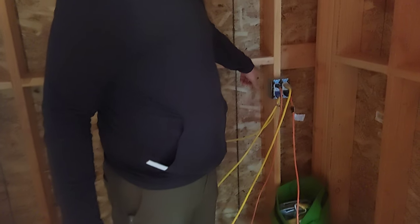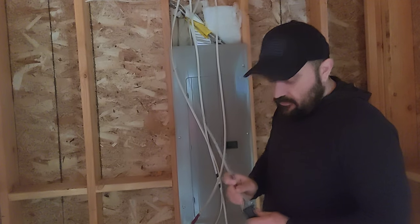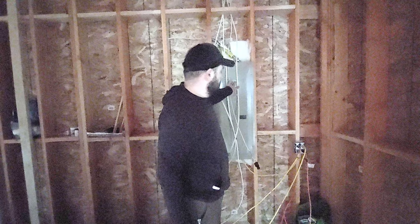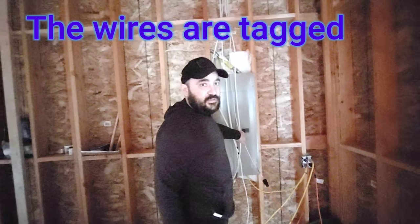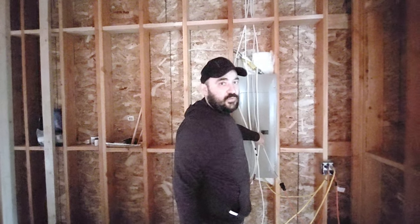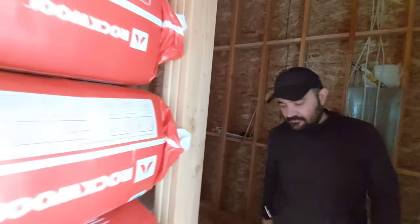It's not yet connected to a breaker in the panel box — I'm using a cable coming from a temporary outlet to check everything and make sure all the wires are going in perfectly. When I'm done with all the lights, I'm going to install them — they're all 15-amp breakers for the lighting circuits since all lights will be LED. All outlets will be minimum 20 amps, and the breakers will be 20 amps. We'll catch up after I finish this.